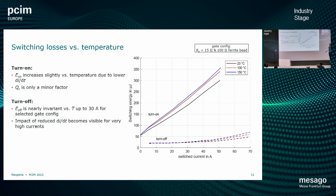When we look at the switching losses — we have turn-on losses which are typically higher for each device type — you can see that the di/dt change leads to a slight increase in turn-on loss, but it's not substantial. And at turn-off, going up to 30 amps, there is virtually no real change to be expected here.